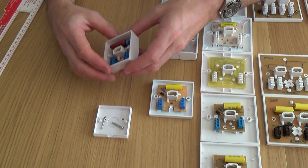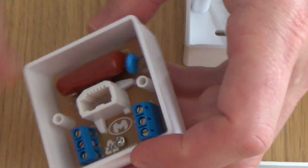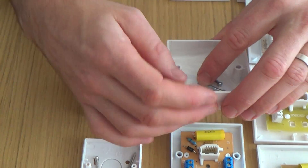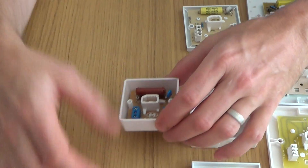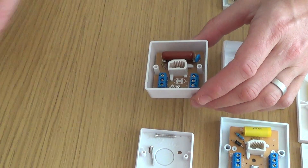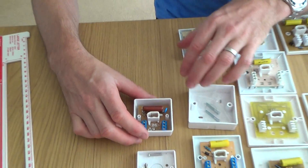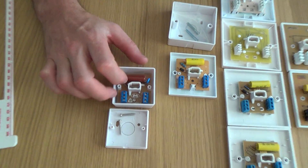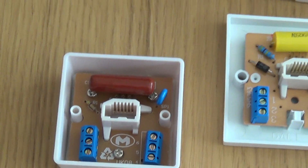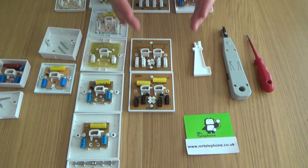The one series is not really used nowadays. The back box is incorporated into the socket itself, making it a wider unit with a small back plate that screws directly to the wall — unlike the two series where you feed cable through a separate back box first. These are a smaller socket type, roughly 51–52mm. The same naming logic applies: screw terminals with all mastering components would be a 1/4A; with IDC connections it would be a 1/1A.